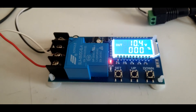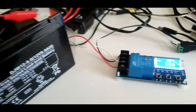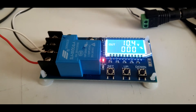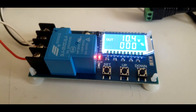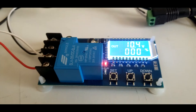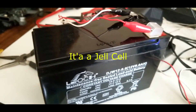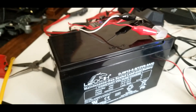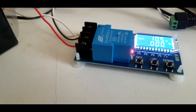What it does is it can charge batteries. The reason I got it is the ad said 'lead acid batteries charger control monitor,' and it also mentioned lithium batteries, so I figured it was for everything. But it isn't — as far as I've tried, it won't charge lithium ion batteries, and I assume it won't charge LiPo batteries either. I think the reason is that a lithium ion battery is pretty different from a lead acid battery, and it might check the impedance or capacitance of the battery.